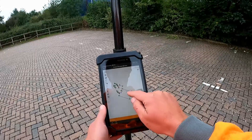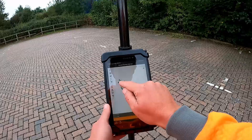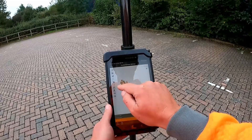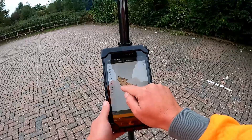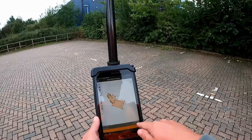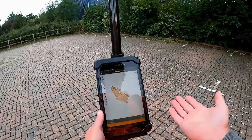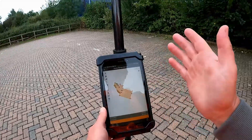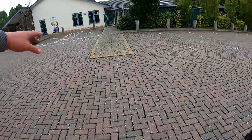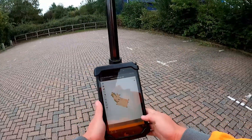For area, I click on the area I want to capture, clicking on all my points. You can be as accurate as you want around curves — the more points you select, the more accurate your area calculation will be. It's telling me I've got 492.77 square metres — essentially 493 square metres. As quick as I've filmed it is how you can do this. I know exactly how big this is without any guesswork.